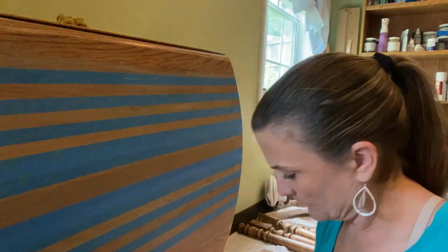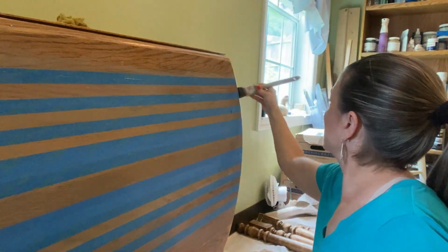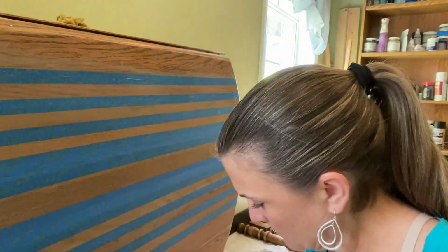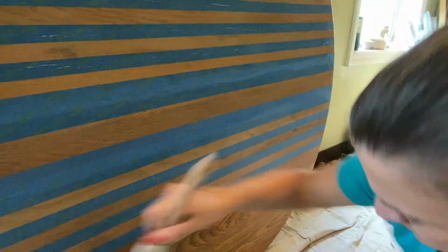I know from experience that because this tape has a lot of paper in it, it will wrinkle. So I'm going to put on a very thin coat, and I will likely put on 2. I don't want to oversaturate the tape. It might wrinkle and start to withdraw.